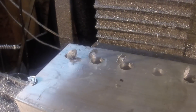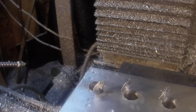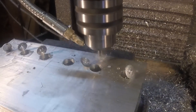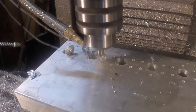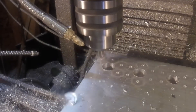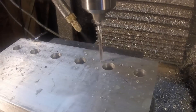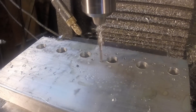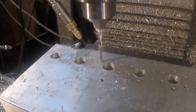On the back side where the bolts come out, instead of threading this because it's aluminum, I want to press into it — I'm going to pull in some nuts. I figure that'll help the fixture last longer and keep me from pulling out the aluminum threads. It's the same process as on the top but just for a different size.